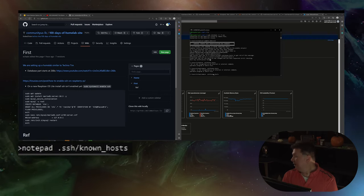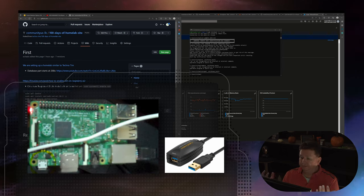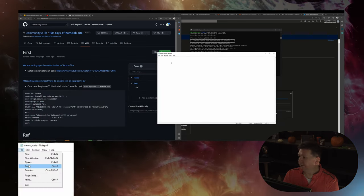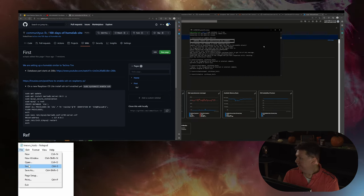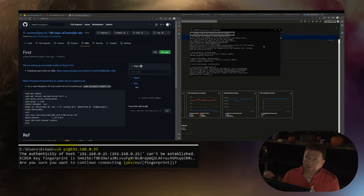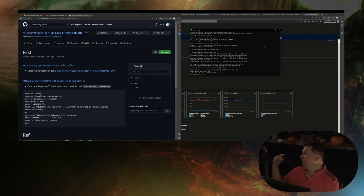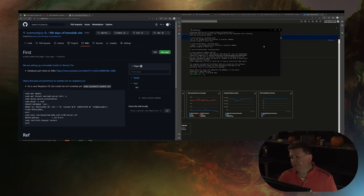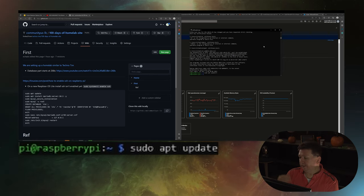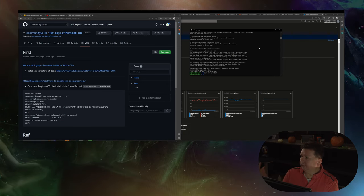So anyways, what I'm using, I have an extension cable that I'm powering one Raspberry Pi off of. The old Raspberry Pi 2, which wasn't so beefy on the power requirements. And then I have another one that I'm plugged into one of my node computers that I'm going to use in my cluster and that we're setting up now. It's just plugged into the USB 3 slot on that. I try to use the GUI mainly out of laziness, not because I wanted the overhead. And it kept running into power requirement issues.